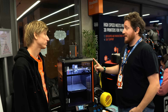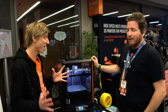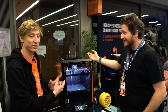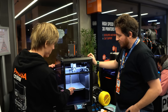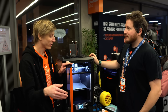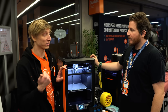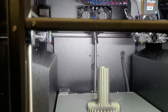You guys did something I didn't even expect — you made an upgrade path from the Mark 4S to the Core 1. And it's not a case of replacing everything; you're reusing a lot. If you look at the machines side by side, they're super different, but you use the Mark 4S heat bed. The sheet is the same size — it has different graphics because you can print more over it — but everyone who bought extra print sheets can use them on the Core 1. Everyone who bought nozzles can use them on the Core 1 extruder, because it's the exact same extruder.